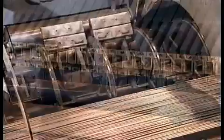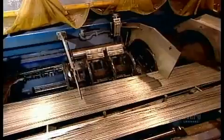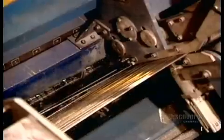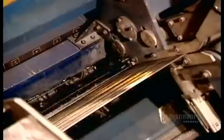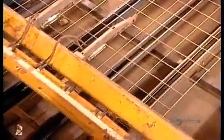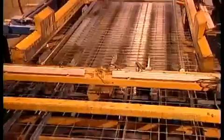At the welding station, a magnetic arm grabs the panel's horizontal pieces and feeds them one by one into position over the vertical pieces. Then the welding begins. This is electrical welding. A strong electric current zaps the joints, melting the metal and fusing the pieces together. It's faster and neater than traditional welding. The machinery then stacks the welded panels and moves them down the production line.